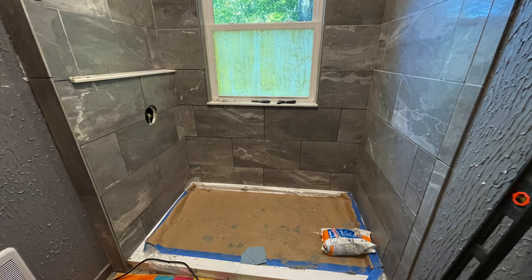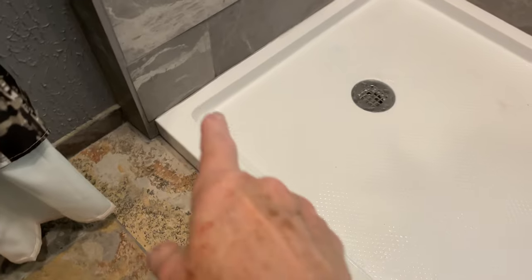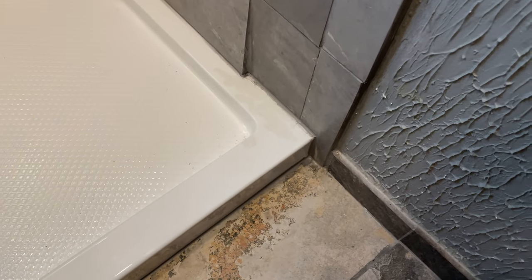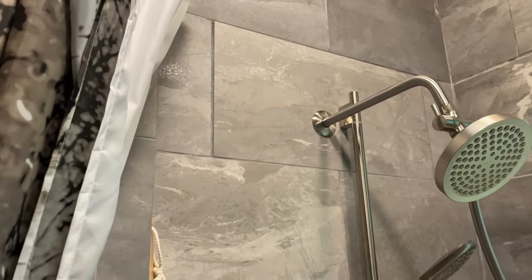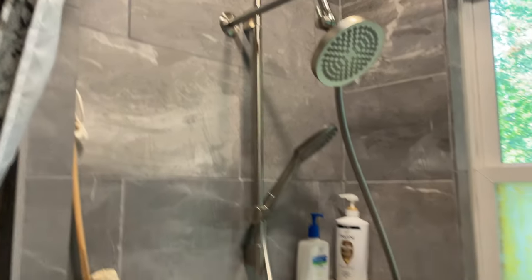As it turns out, I did not change and drop that valve back. I left it where it was and I put the marble shelf back in place. So the distance between there and over there is about 58 and seven eighths inches. So it gives me about a quarter of an inch leeway and that's what they allow for.